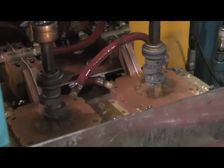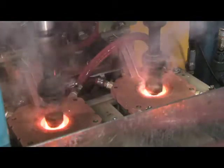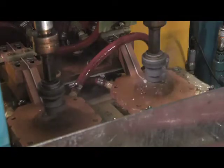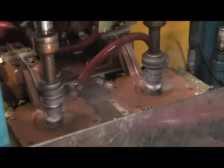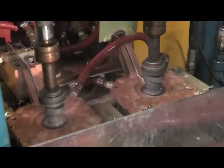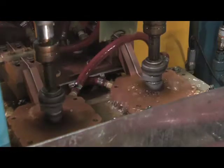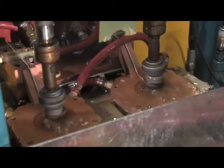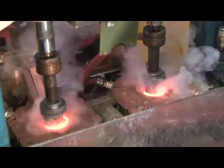We have four more journals, four more lobes and one bearing left to heat treat. The entire cycle time here is around six minutes. Since we're heat treating two cams, the cycle time per cam is about three minutes, which is extremely fast. Compare that to the carburized camshafts — those camshafts can be in the furnace for 35 to 36 hours before we get the proper case depth. Whether you like induction hardened camshafts or carburized camshafts, Kali's can make both cams to suit your needs.